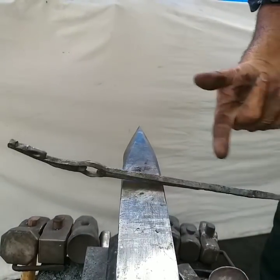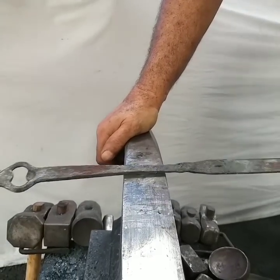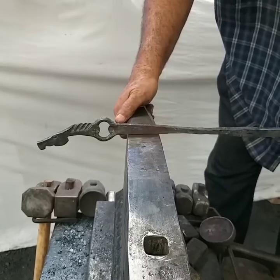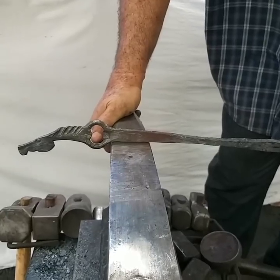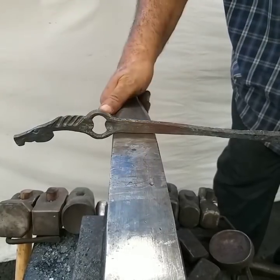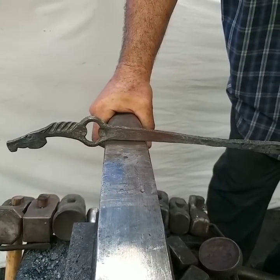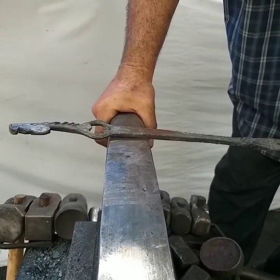Too bad I had that little burnt spot, but I can actually work that and repair that somewhat by having to work it. If I wanted to go here, I could still come in here and move this down. But all that up there is finished. Don't try and finish things right off the bat. You develop things, and then when you're going to be at the end of an area, you can finish it. So you're not putting that continually back in the fire. People wonder why my work is clean. That has a lot to do with it. Doing what you can in the heat, moving on and finishing later on.